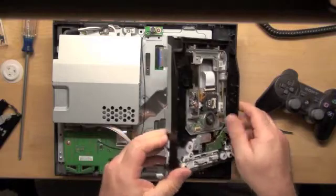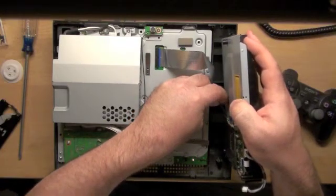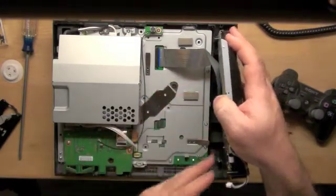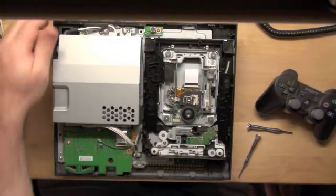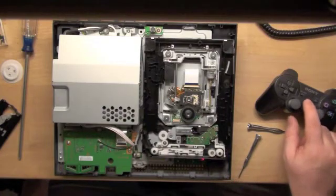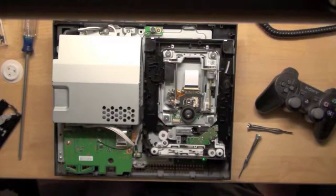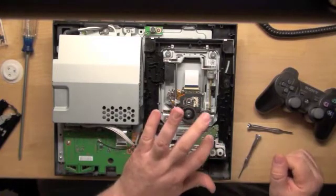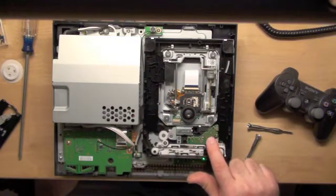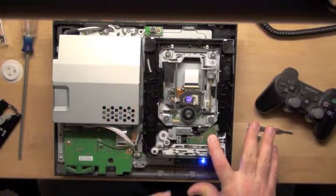I'll put the data cable back in and make sure it's aligned properly, put everything back in and fire up the system. Yeah, now we're rolling. It'll time out and I'm going to simulate a disk being pushed in. Nothing happens when I close this left switch here. But when I close the left switch and then I close the right switch, things start rolling. I'll just simulate it being drawn in.